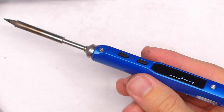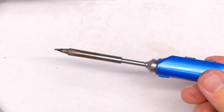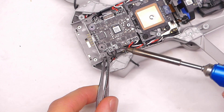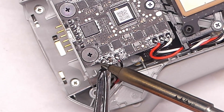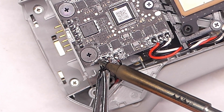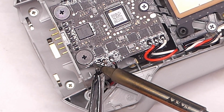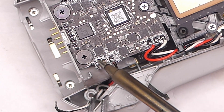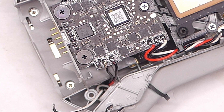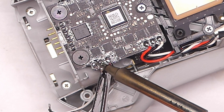Now it's soldering time. I'm using my TS100 — really love this soldering iron — but you don't need a fancy one. As long as you have a decently small tip you'll be fine. We're just going to remove the three motor wires from this pad right here. It may take a little bit longer because there's a clear lacquer coating on the solder pads, so just scrape it off or burn through it — it's just like any other solder job.